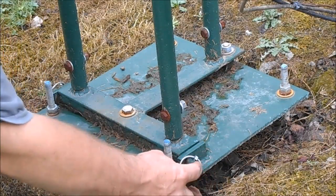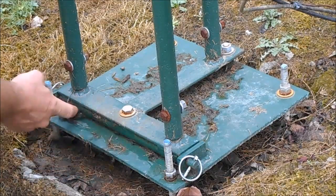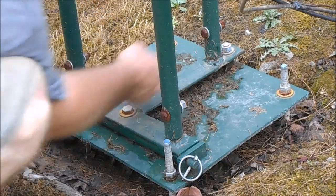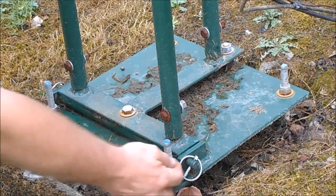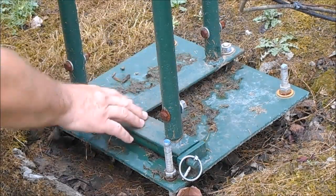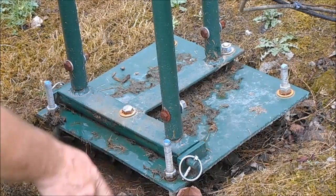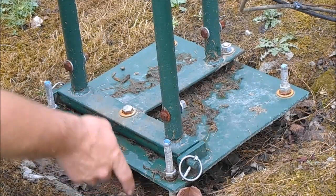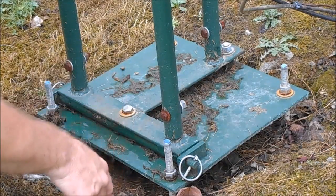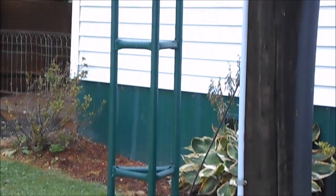The base of my antenna is just a pin with two little clips, and I welded a piece of half-inch pipe through there. All I've got to do is take this bolt out and this half-inch pipe makes like a big hinge — you can lay this thing right down on the ground. I've got a bolt here and a bolt here to keep it sturdy. This is about three feet deep, solid concrete with rebar beat down inside the ground. This antenna is sitting on a 20-foot tower.